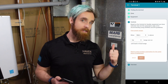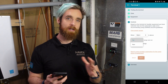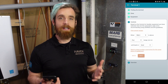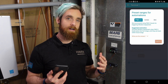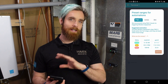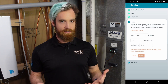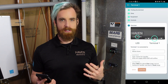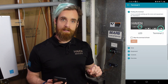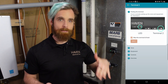For example, if you used the Central Air System template with a filter rated at MERV 11 or higher, you should select PM 2.5 as your measurement for the automation. You can set the automation threshold to either fair or poor, depending on how sensitive the occupants are to IAQ issues — it'll tell you right there in the app what those thresholds are. Setting the automation to trigger on fair is appropriate for sensitive individuals, but most homes should be fine with the threshold set to poor. If you are also connecting a second piece of equipment, repeat the setup steps for the second terminal; otherwise, skip terminal 2.